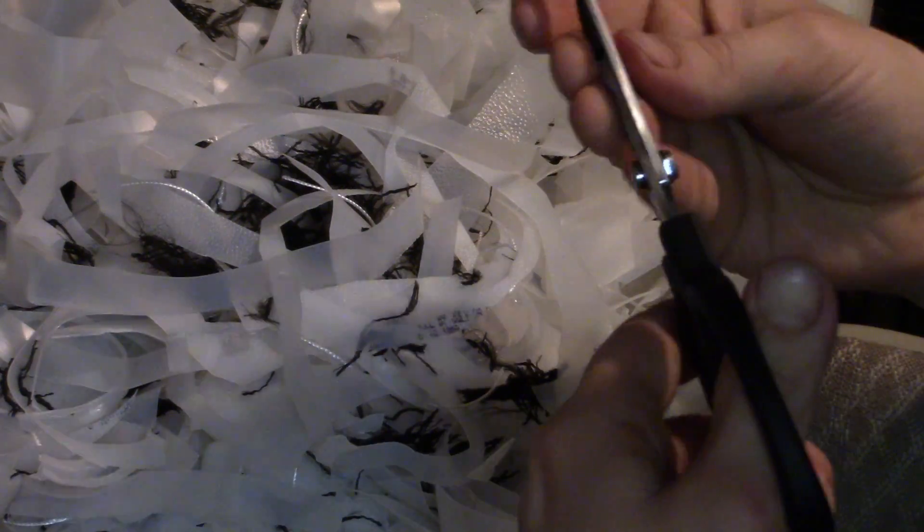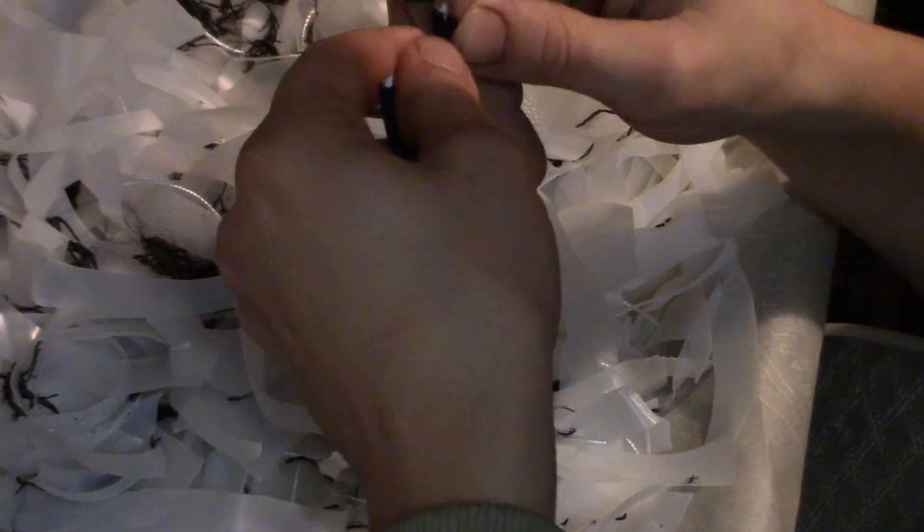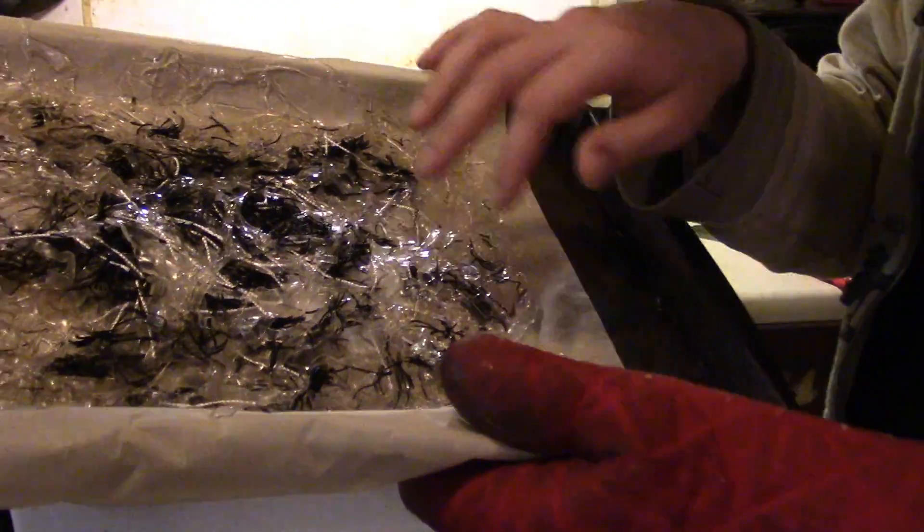Now onto molding the plates. As you can see here, I chopped up about five milk jugs — just take a pair of shears or a sharp blade and you can cut it up. Here are some clips of a failed attempt where I tried to impregnate nylon paracord into it. It seemed from earlier tests to indicate it would be tougher as far as resisting breakage. But I had no idea that HDPE was so ductile — it doesn't break into little pieces; it absorbs energy and kind of stretches when impacted.